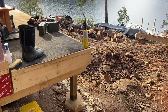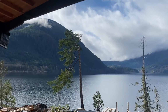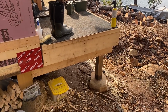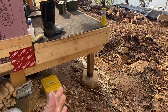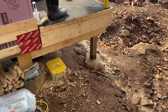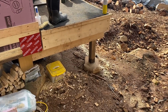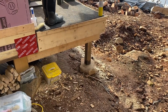Stopped raining. The sun is coming out. Beautiful day in February, which is rare. And I need some steps. So I'm contemplating 4 steps that are about 7.5 inches, or like 5 steps that are like 6 3/4 inches. I kind of don't want it sticking out super far.